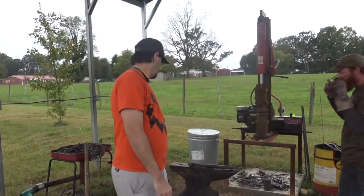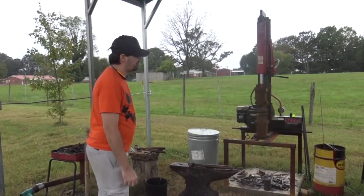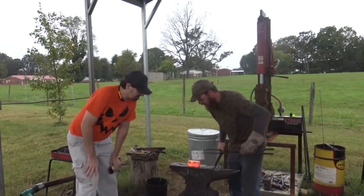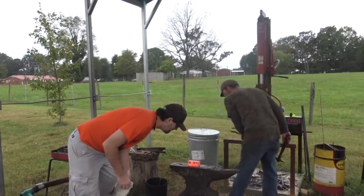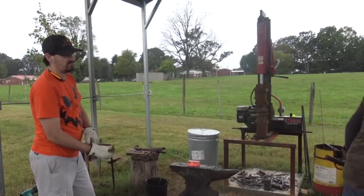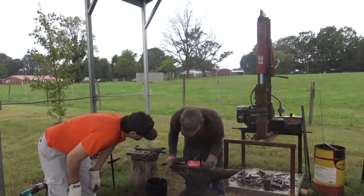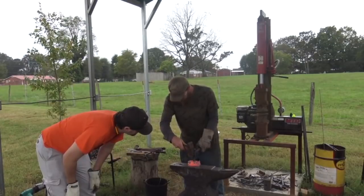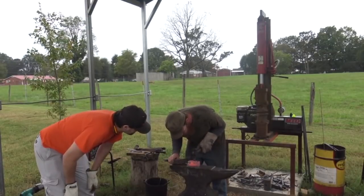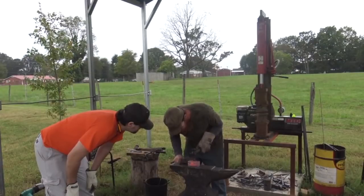I think we got it hot enough now, Allan, we can mark it at least. So I'm going to get it marked real quick, and then we'll start doing some striking, because I got to learn how to do this. Pay attention. You're more than welcome to watch instead of striking. That way you can learn up close and personal. See, I've got it center punched there. I did that before I find my other hammer. Center punch it before you go. Yep. Find your center and you just want to give it a pin prick, a little tap, so you can come back and look at it. And if it's not where you want it, you can adjust. I think we got it centered there good. Okay.